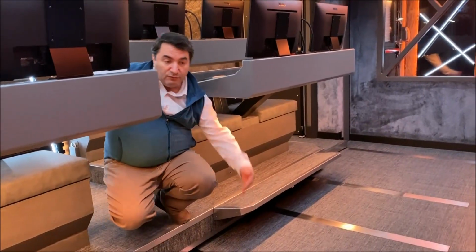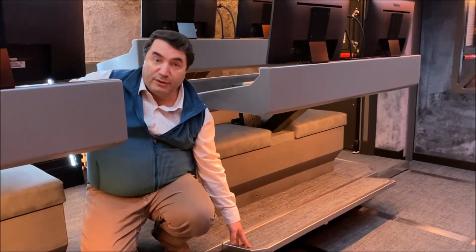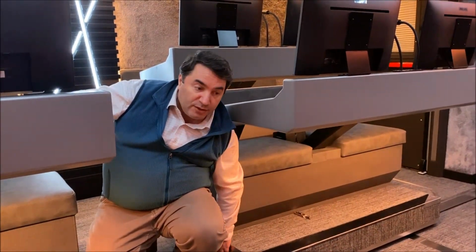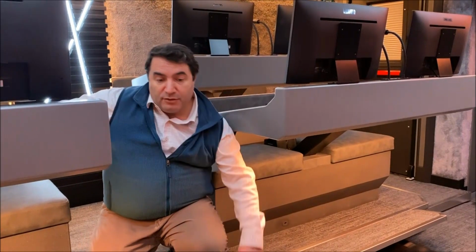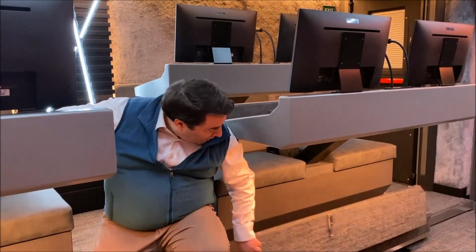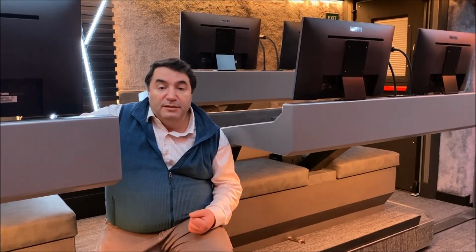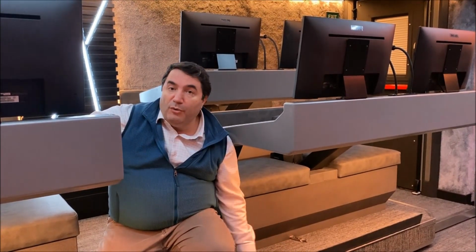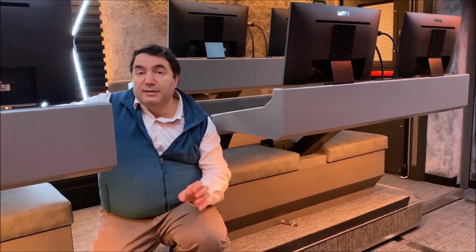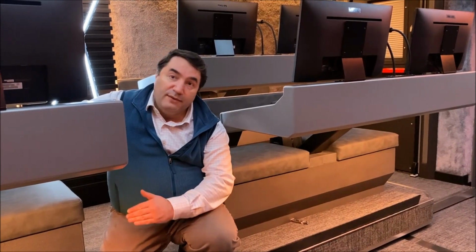Why folding? Because when the vehicle is closing, the expansions are closing, we don't have space for these. So for road condition, we would be tucking them away like this, but for operation, we would be putting them like this. So does this cause some safety problem? Not actually, because we already have our locking mechanism here, but that locking mechanism does 2 things. One, it prevents this from opening during vibrations on the road, but foremost, it also presses a button inside so that the automation system does know that these are in folded position, so it is now safe to close this area.